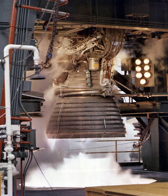The fuel and oxidizer flowmeters were helical-vaned, rotor-type flowmeters located in the fuel and oxidizer high-pressure ducts. The four-vane rotor in the hydrogen system produced four electrical impulses per revolution and turned approximately 3,700 rpm at nominal flow. The six-vane rotor in the LOX system produced six electrical impulses per revolution and turned at approximately 2,600 rpm at nominal flow.